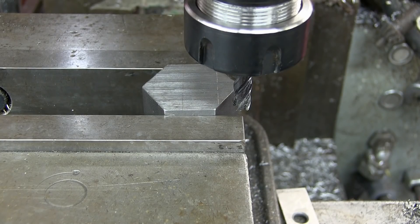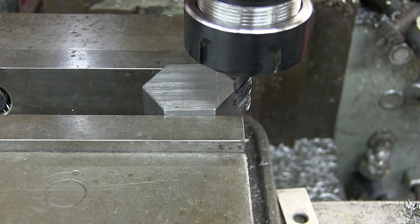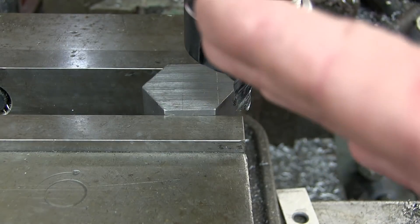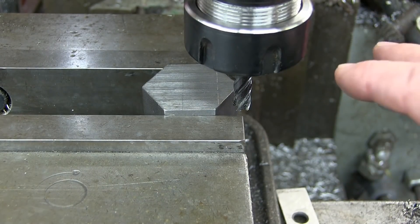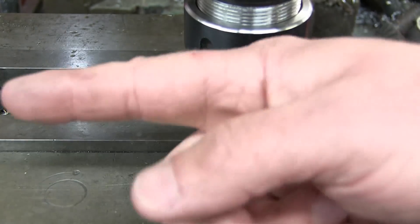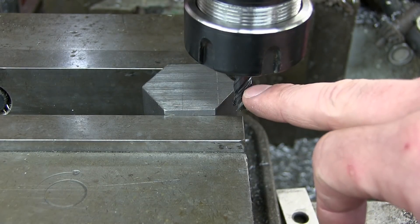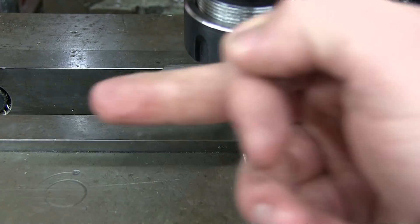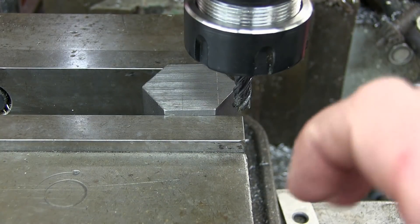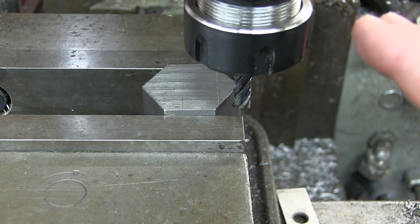To the clapped out Bridgeport milling machine. Ever tell you about the time I became a man? It's when I clapped eyes on this beautiful bunny rig — 110th unit of 1987. Clapped right out. I saved her from the glue factory and she's got a back to prove it. The saddle on this thing just wallered right out. Real machinists would never use this machine in a million years, and a lot of times when I'm doing hard stuff I go the wrong direction. That's because the saddle is wallered out, and especially on hard stuff we're using tungsten carbide — doesn't like the chatter so much. So that is why I run it this way. Don't be incensed at comments by real machinists that I'm doing it the wrong way, because they ain't ever used a beautifully clapped out Bridgeport milling machine.